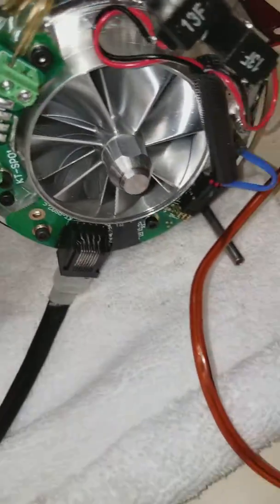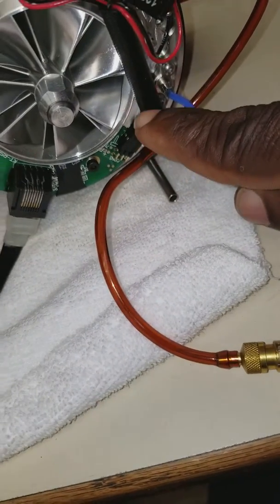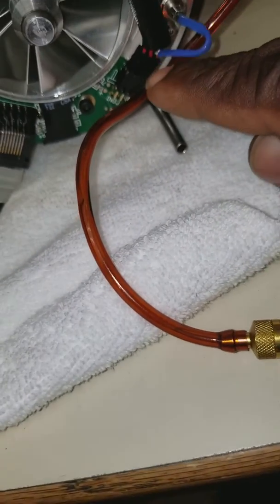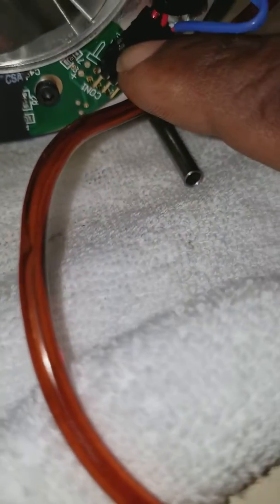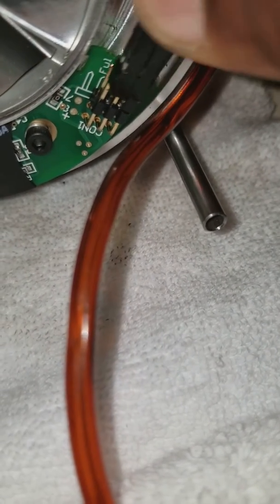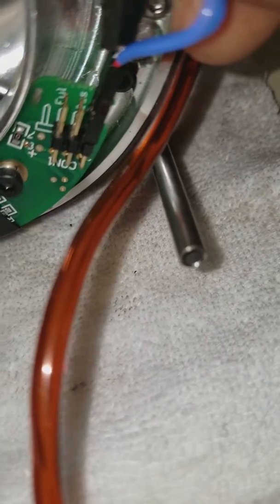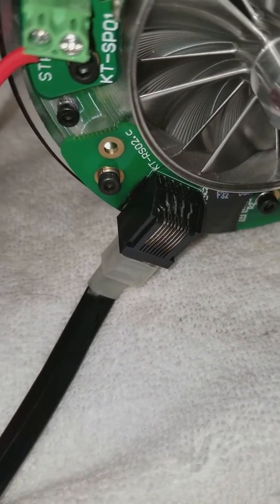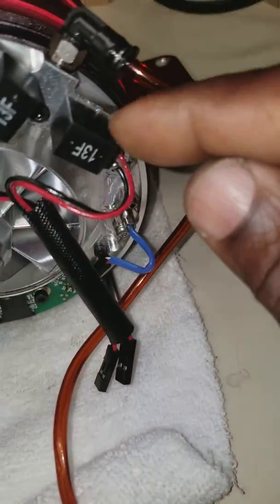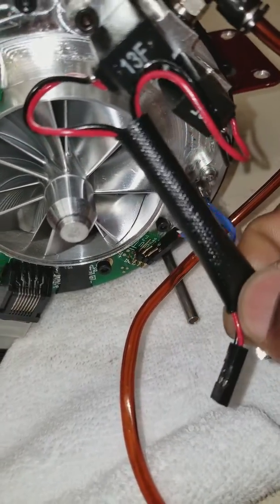If you have more problems, contact King Tech — but this is just my home remedy. Another way to test: pull each cable, and make sure you mark which one is which, because one side is gas and one side is fuel. You don't want to mistake the two. There is a marking — this one is fuel. The one closer to the compressor is the fuel, and the one inside is the gas.